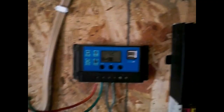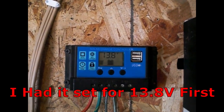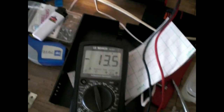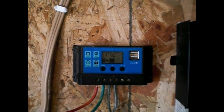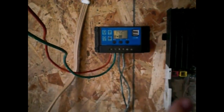This one on the other hand made me a liar. I went to go hook this one back in, I set it down for 13.8, then went ahead and set it for 14.2 just to bump it up a little bit. According to this, it is sitting right at 14.1, 14.2. As soon as it got up to 14.2 it went into float mode and dropped the batteries down to its normal level. This charge controller actually seems to be working just fine. We're gonna leave that one alone — it is sitting at a normal battery level.